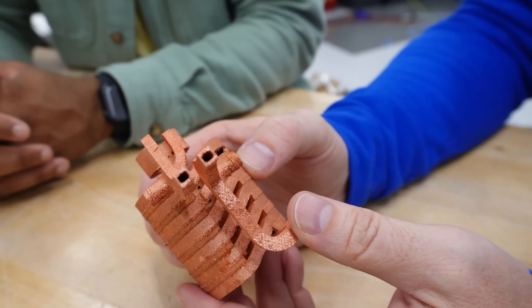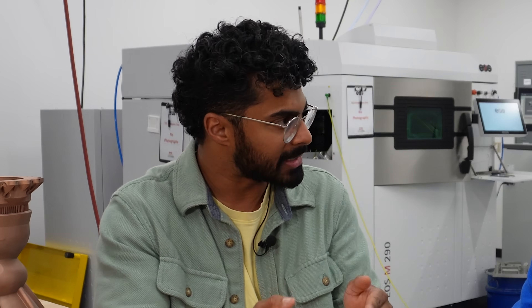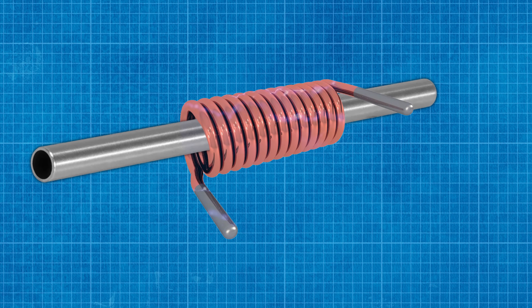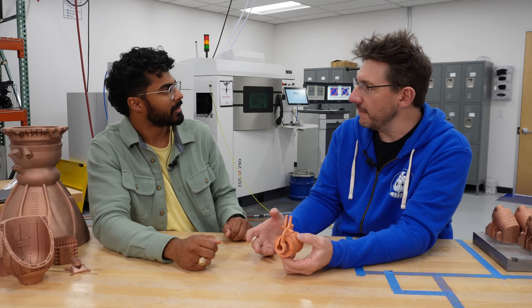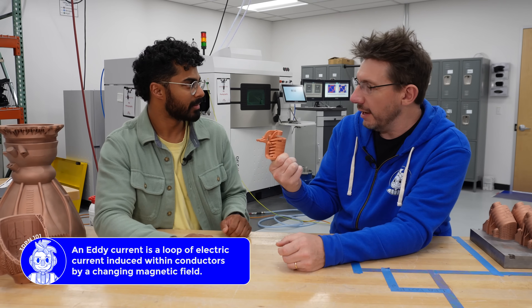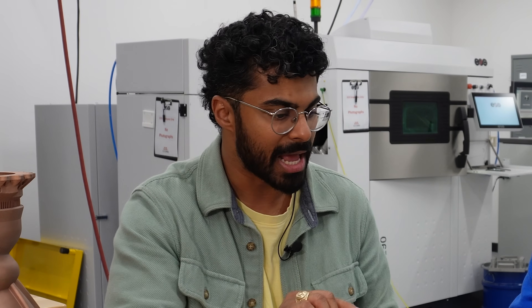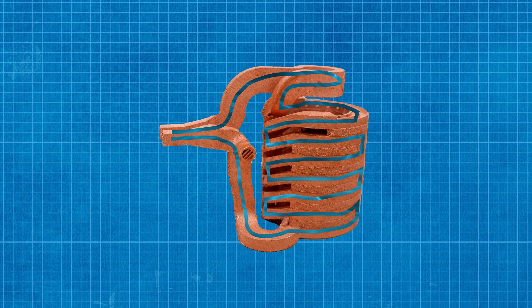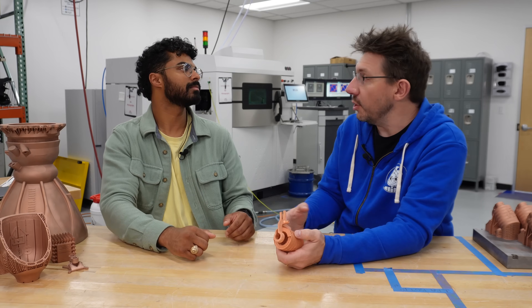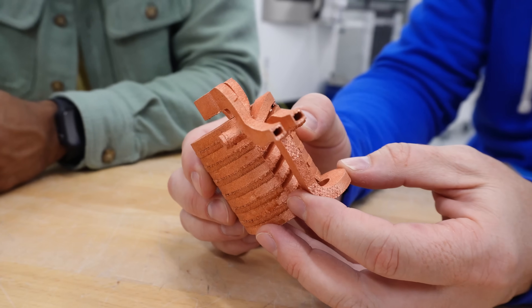This looks great. What is this? So this is an inductor. We use this for inductive heating. You have a workpiece that you want to heat up, and instead of contacting it, you can use the principle of induction to induce eddy currents in the material, so it heats without contact. There's a lot of machine automation in factories that have to heat a metal piece and it goes nice red hot — that's the eddy currents being induced. So it's typically a coil, but what we can do with this 3D printed version is have a channel running through the coil that has coolant in it. With that coolant, you can cool this part and reduce your cycle time. And you're not going to be able to do that with another manufacturing method — you have to make that with additive because making those tiny little channels is not easily or at all manufacturable another way.